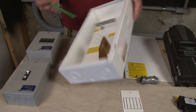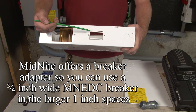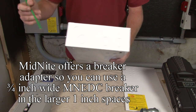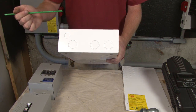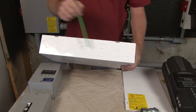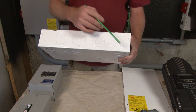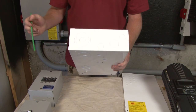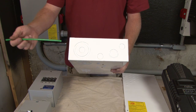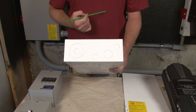It also has a location for a 125 amp, 175 amp, or 250 amp battery breaker. It does have a variety of knockouts — on the top it has the industry standard knockouts to line up with the charge controllers, plus a couple of extra ones. On the side it has some larger ones to line up with conduit boxes on the SWs, for example. There's also a location for an SPD — a Midnight Solar surge protection device — with a large knockout to line up with the battery breaker studs so that if you're hooking up large battery cable it's very convenient.